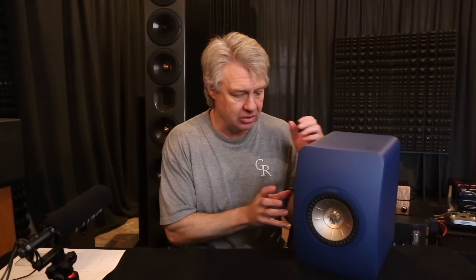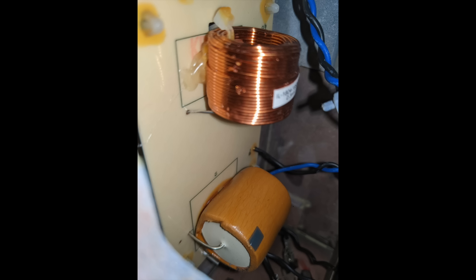Then we dug inside. The crossover is built on two boards, sandwiched in the corners around the bracing, so it's almost impossible to get to. They didn't make this thing to service. The tweeter circuit has only one poly cap and one air core inductor — I've heard from a few guys online that it's a Clarity Cap they put on the tweeter, so not just a cheap poly cap. It's a pretty decent cap, so it should have reasonable clarity in the top end. They didn't put junk on there.